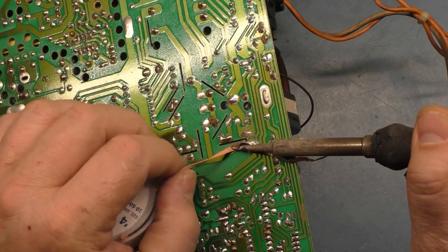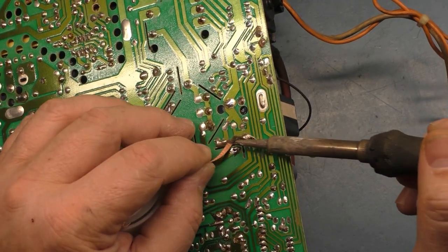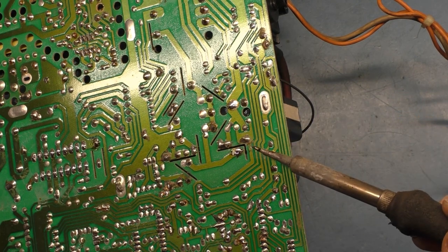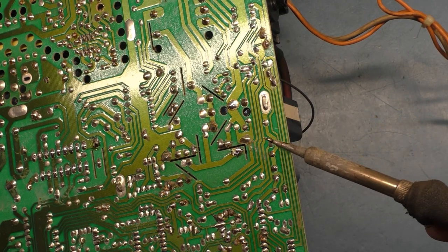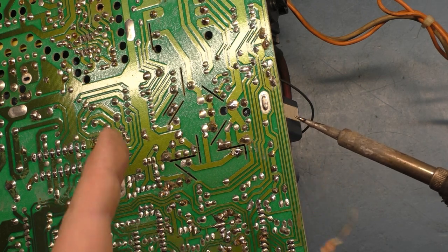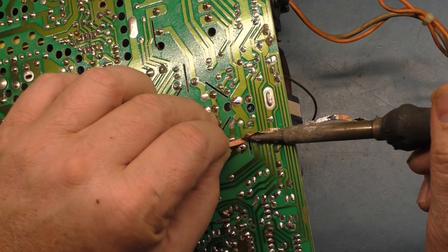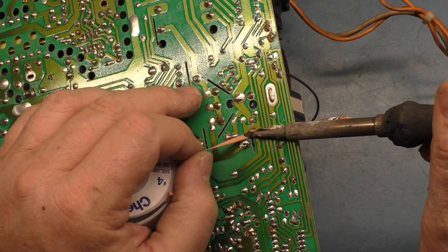And again, if all that checks good, if you take the HOT out and it reads shorted, and the pads read fine, you put a new HOT in and it gets taken out immediately, R760 and R765 are the likely culprits. So those are the next step in troubleshooting you want to do if you have that scenario on your hands.